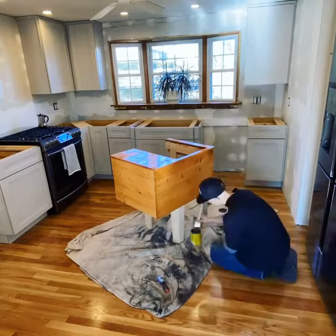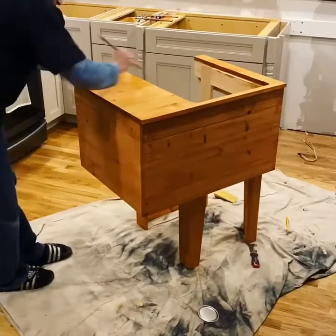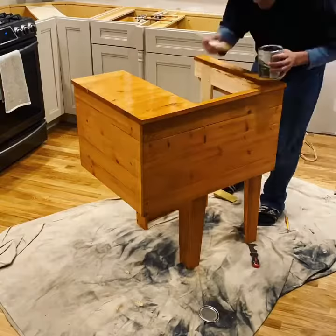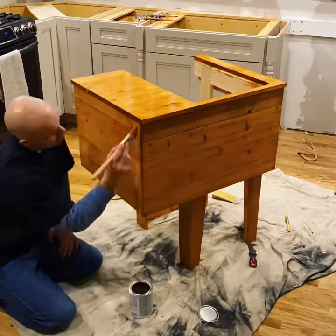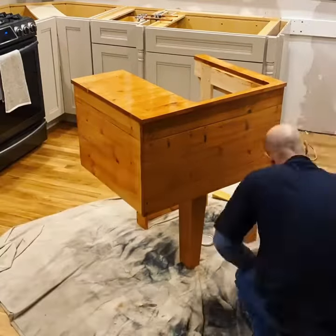This is showing the first coat after it dried — about six hours. Then I put two coats of exterior polyurethane finish. I figured I'd use exterior since it's going to get wet, considering it's a sink.